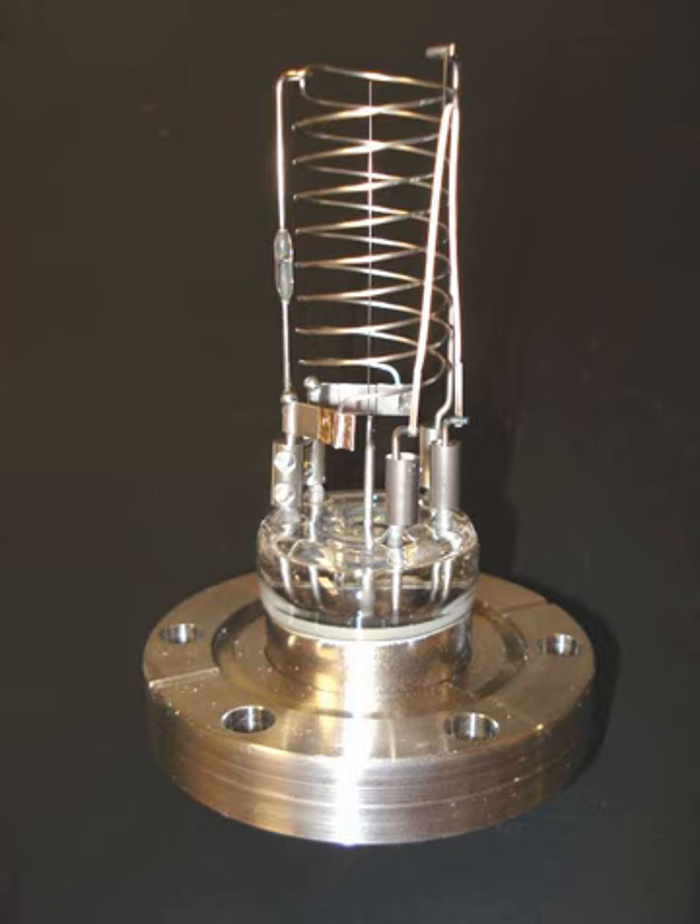In the extraction type, the ions are not attracted by a wire but by an open cone. As the ions cannot decide which part of the cone to hit, they pass through the hole and form an ion beam. This ion beam can be passed on to a Faraday cup, a quadrupole mass analyzer with Faraday cup, a microchannel plate detector with Faraday cup, or a quadrupole mass analyzer with microchannel plate detector. Ion lenses and an acceleration voltage can direct the beam at a target to form a sputter gun, in which case a valve lets gas into the grid cage.